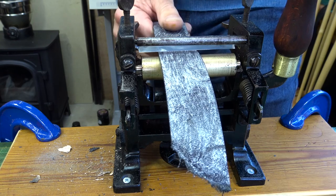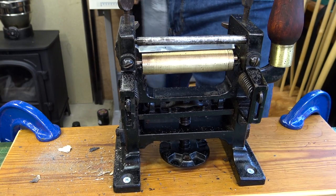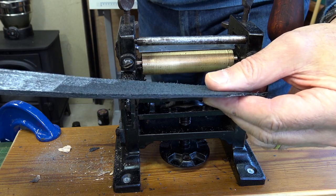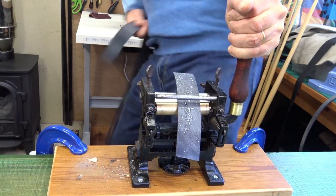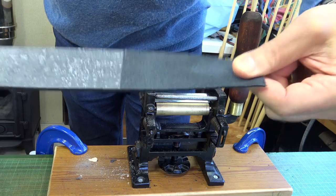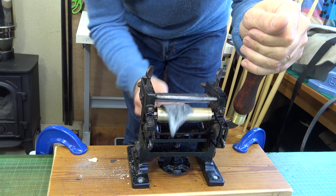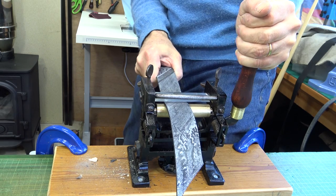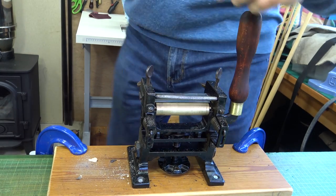Rough side uppermost, then pull. It's a bit of a knack pulling this lever back slowly, but you can see you get a very nice tapered skive. It takes a bit of practice to get it really good — if I don't get it quite right I just finish it off by hand slightly afterwards, which is quite easy. That's your tapered skive there.